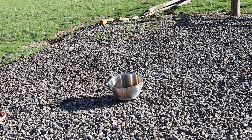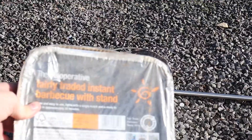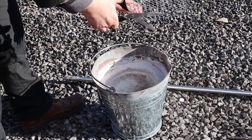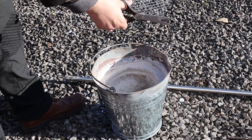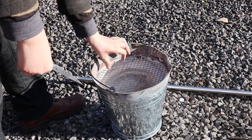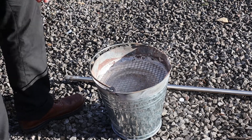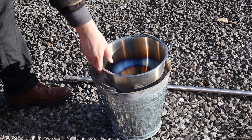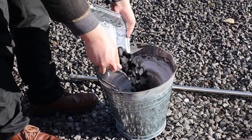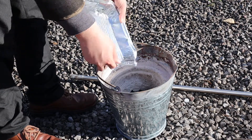Putting the bowl to one side, I went about setting up the mini metal foundry bucket furnace. The bowl has quite a large internal volume so I decided to try heating it from below using charcoal and above with the blowtorch. So the bowl wasn't sat directly on the coals, I used a mesh from a disposable BBQ as a platform for the bowl to sit on.